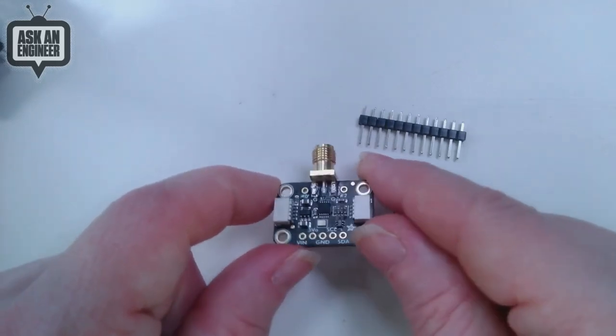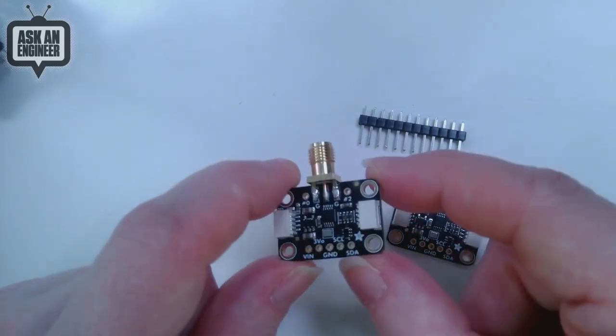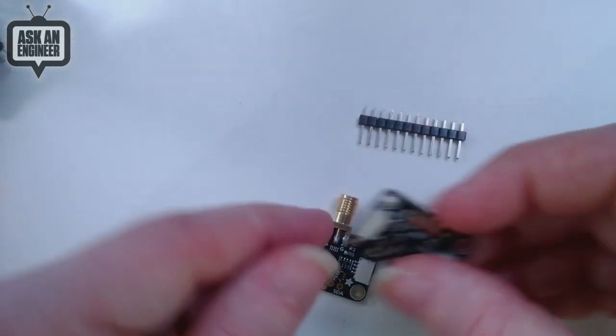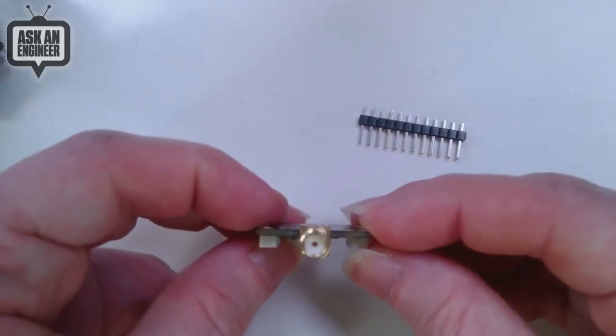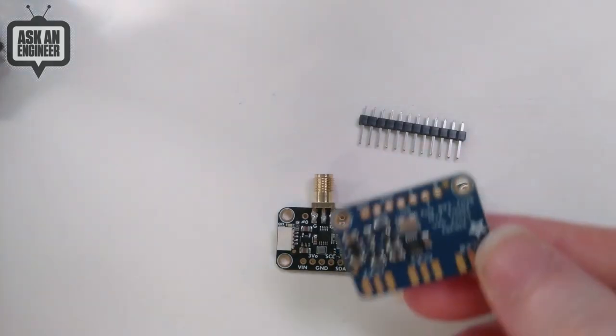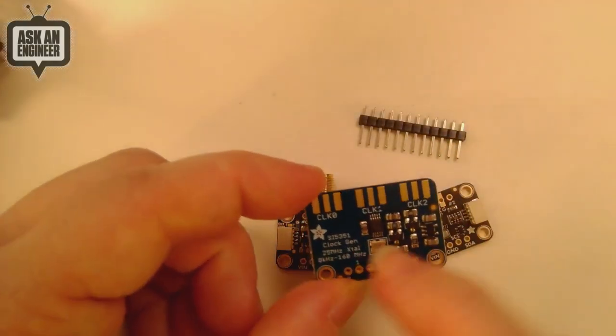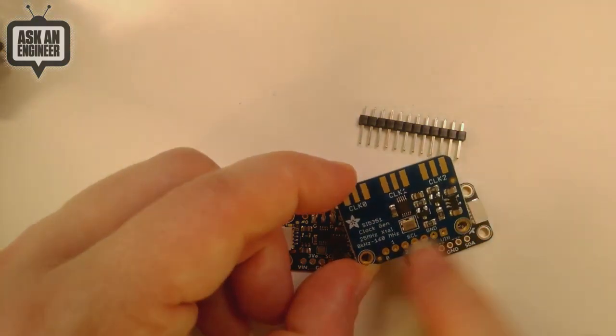You can still connect one RP SMA or SMA connector. Use the edge launch, and you just solder it on. The pads line up actually perfectly, so you can just solder right onto them. So here you go, and you have one output, and that's actually what most people want. If you want to have SMA edge launch connectors for all three outputs, you should keep with the old version, which looked like this, and had the three outputs at the top, and then also mimic down here.